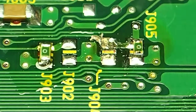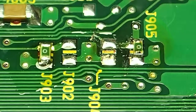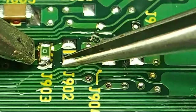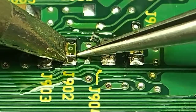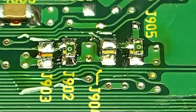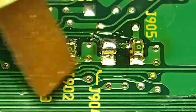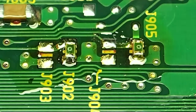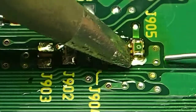I've left some rubbish behind, I'll just clean that up. The secret here is to try and get both ends to melt at the same time - if you can get that to happen then you're in business. Sometimes you'll have issues with them not taking completely the first time, so just once again more flux, and then you can get in there once again with a clean soldering iron tip.